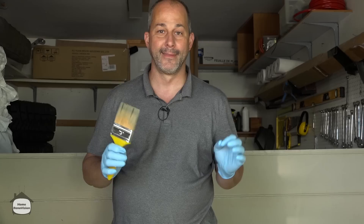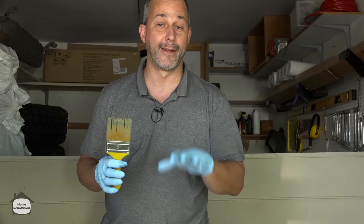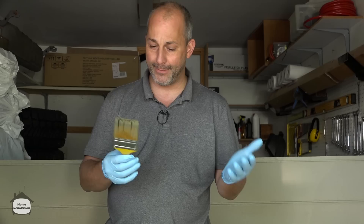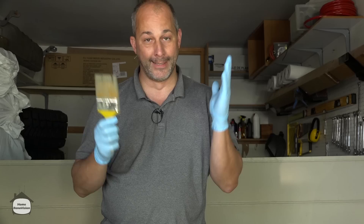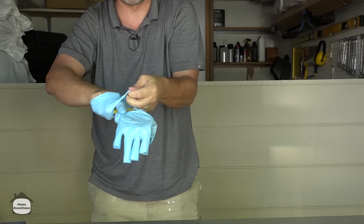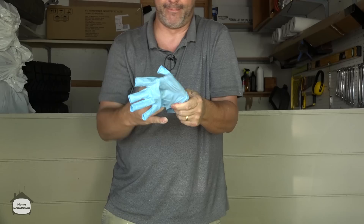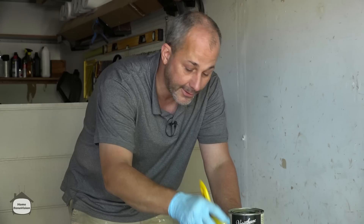Here's a pro tip when using your brush with oil-based products: you don't want to wash it out, yet you're dealing with a situation where you do one side, let it dry for a day, flip it, do that side, let that dry for a day, possibly another coat on each side — that can be four days and four brushes if you don't take care of it. Here's the secret: grab your brush and take your gloves off when you're done. Your nitrile glove can become the container for your brush. Just set the brush inside the glove — there's no air getting to it, and it'll be in perfect shape for you tomorrow.